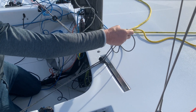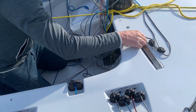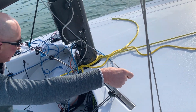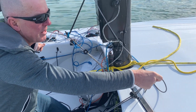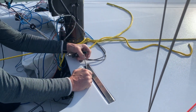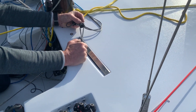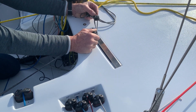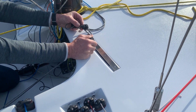We also have an in/out control, so we can bring the sheeting angle in closer or let it out from the other side of the boat. We may even trim it actively if it's puffy on the upwind when the main traveler is working up and down, but more likely it's a little more of a set-and-forget based on the wind strength.